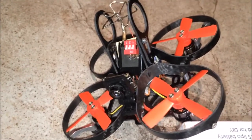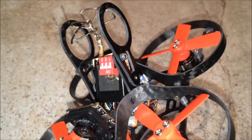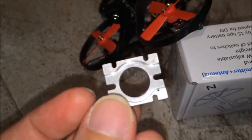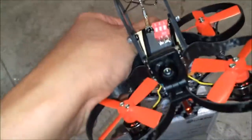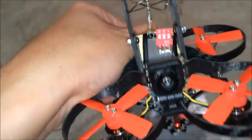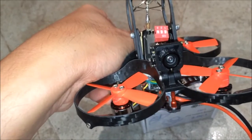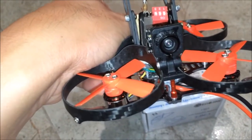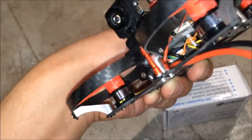So this is how it looks now. I have the camera part of the 3-in-1, and I put in my own video transmitter with dip switches. This is a 200mW transmitter and it's pretty light. To save weight, I removed the aluminum CNC mount and used a piece of wood instead. Here's the piece of wood at the back, the video transmitter, and the camera part of the 3-in-1 — which includes the camera itself with the step-down regulator that does noise filtration. The camera is mounted in front so I won't see the two hoops in frame, secured using two red standoffs.